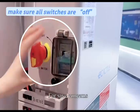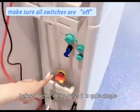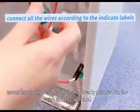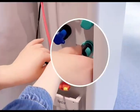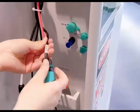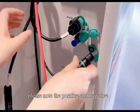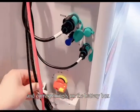For safety concerns, please make sure that all the switches are off before plugging in all the wires. It is quite simple when it comes to wiring. Connect the inverter to the two battery boxes according to the labels, which are clearly marked on the wire and the terminal. The length of the wires also indicates the correct way to connect the terminal. Connect the communication port of the two battery boxes with the communication cable. Please note that the positive and negative poles marked on the label shall be plugged correctly and correspondingly on the battery box.